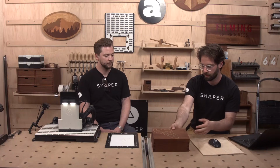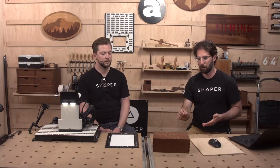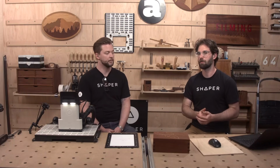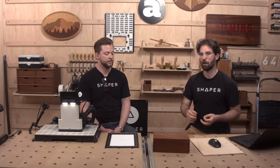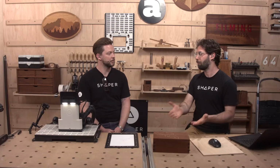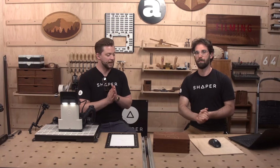The basics of this is that we are going to single line engrave a 1mm channel. We have 1mm square brass wire. And then at the end of the show, we're going to lay that wire in the channel, glue it all in place, and you'll have a brass wire inlay. There it is. And an awesome design.